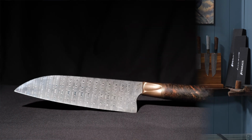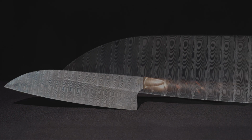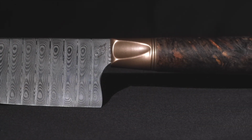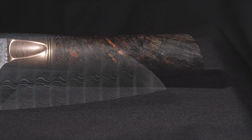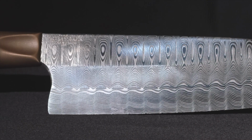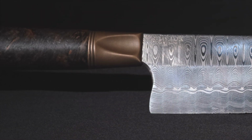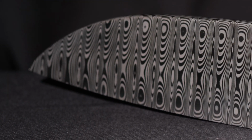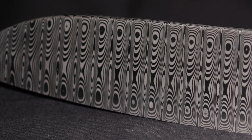Next up, I've got something that's totally new for me. This is a Deba knife. That's spelled D-E-B-A. And this is a very specific Japanese style knife that's traditionally used for removing fish heads. I've always wanted to make one of these knives. They're super cool. And these feature a chisel grind. So you can see that this knife has a nice 3/4 height grind, flat grind on one side, and is left fully flat on the other side.